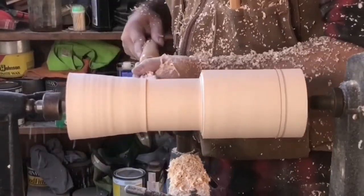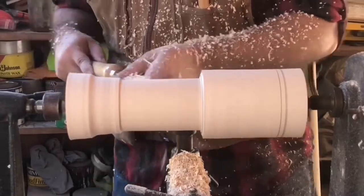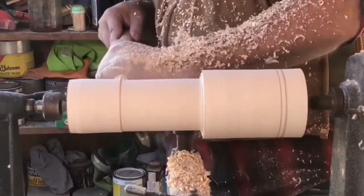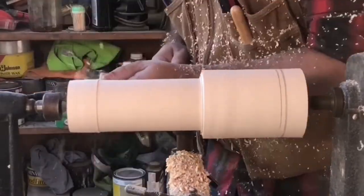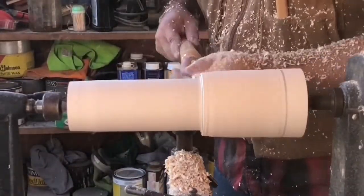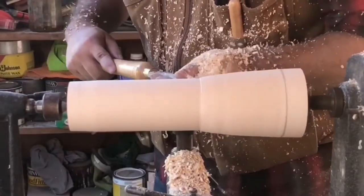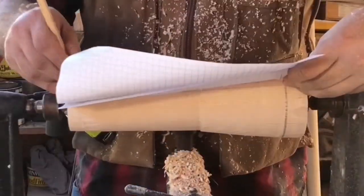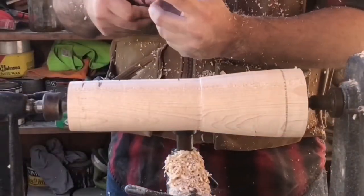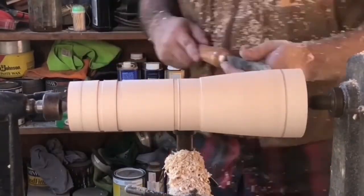The technique I kind of developed over this time was to use the spindle gouge to remove material — that leaves some gouges — and then use the skew chisel to straighten that out so it has a lot nicer finish. You can see I kind of got the hang of it at this point. Now I'm working on the taper with the mallet part, doing the same thing: using the spindle gouge to remove material and then the skew chisel to straighten everything out. Here I kind of show how beginner I am — I'm making marks that I'll just end up removing before they become important.